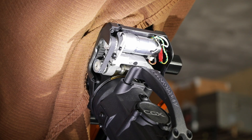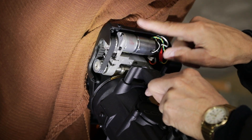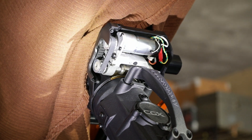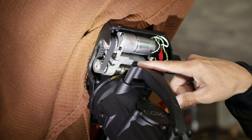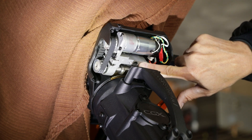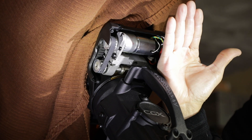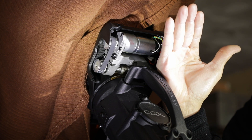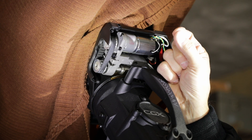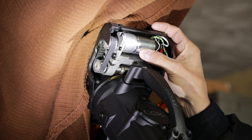Right now I have no slop in the whole housing, but I have slop in my backlash. There are two Allen head screws — a two millimeter here and a three millimeter here. The three millimeter changes the pitch of the whole assembly, and that's what tightens the backlash. The small screw changes or limits how much the whole assembly moves.